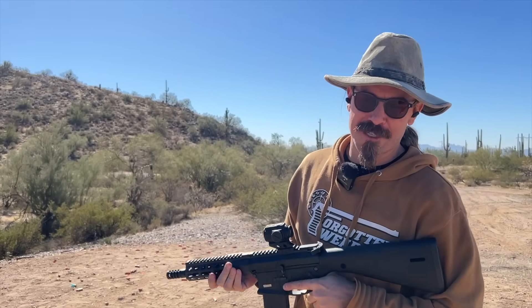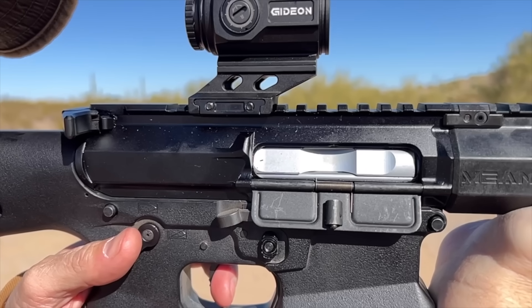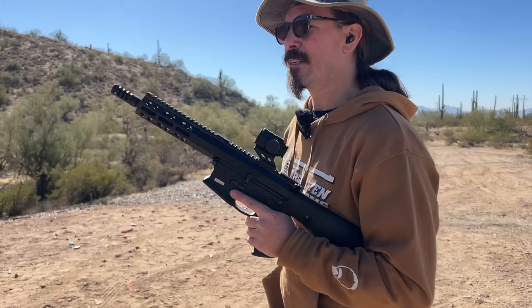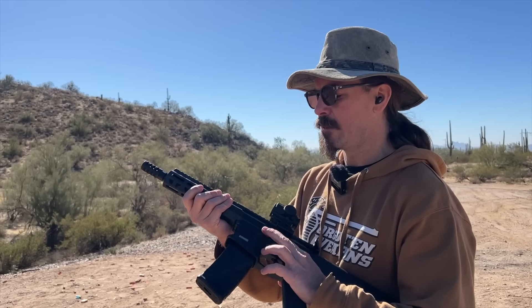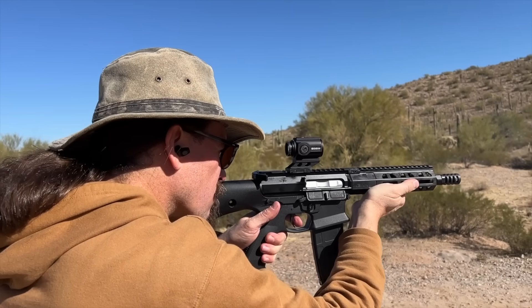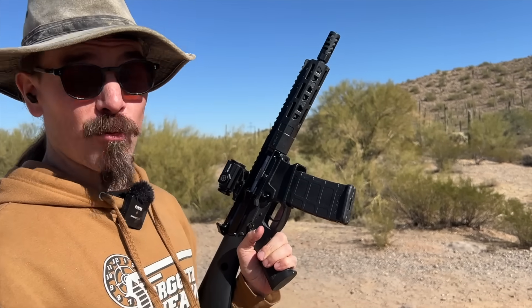That is far, far better. There's your hands-on introduction to tuning 9mm PCCs. You could go way farther than this of course, but that has rendered this really nice and pleasantly shootable. You'll notice it does lock open on empty magazines. Now I'm curious — let's go to the other end of the spectrum. This is 147-grain Magtech subsonic, muzzle velocity right around 1,000 feet per second. That's actually even better — it balances out with this lifter and that buffer really quite nicely.